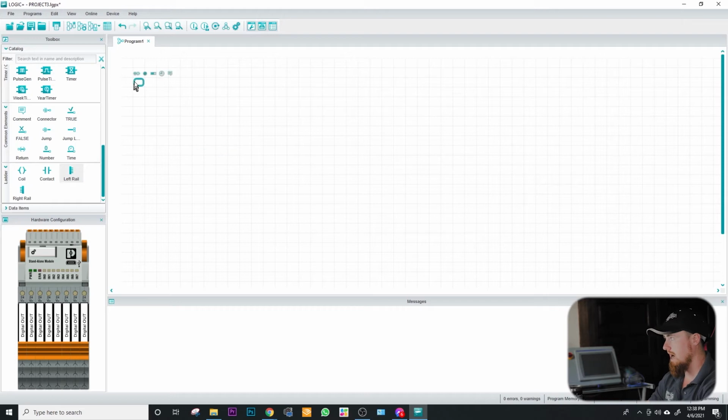Given, if you were going to buy one of these PLCs to learn on, remember, it's not true ladder logic. It's more of a function block programming. So the scan sequences and things may react a little bit differently in this versus a PLC. But overall, if you ask me, programming is programming. And after you know how to program, you can program on just about anything. It's just a matter of learning the commands and the scan sequence.